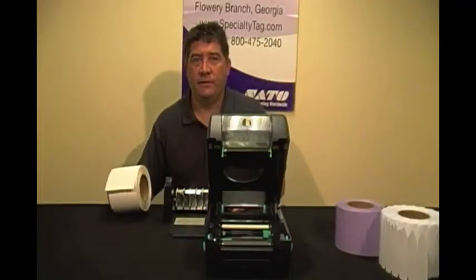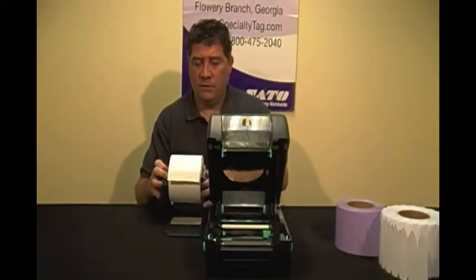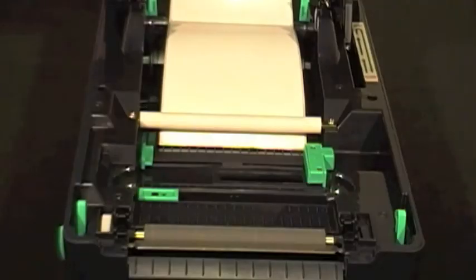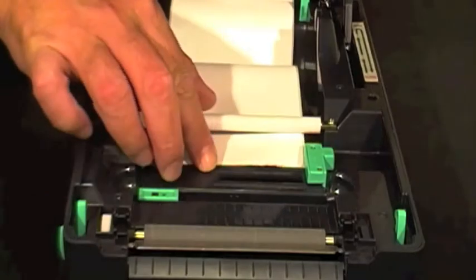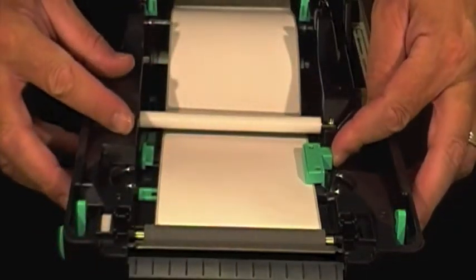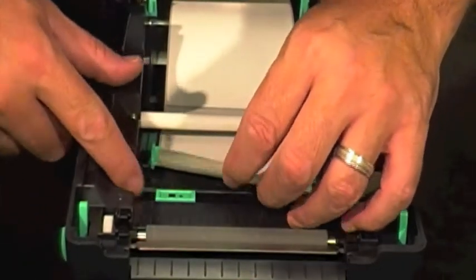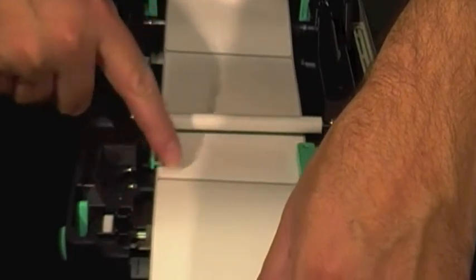Pressure sensitive material can roll off the bottom or, in this case, off the top. Just make sure the label base stock is facing up and the back sheet down. Once the roll mount and labels are centered in the back of the printer, they can feed through the front. Set your pinch guide. Double check that your gap sensor is in position, which is going to read the gap anywhere on this label.